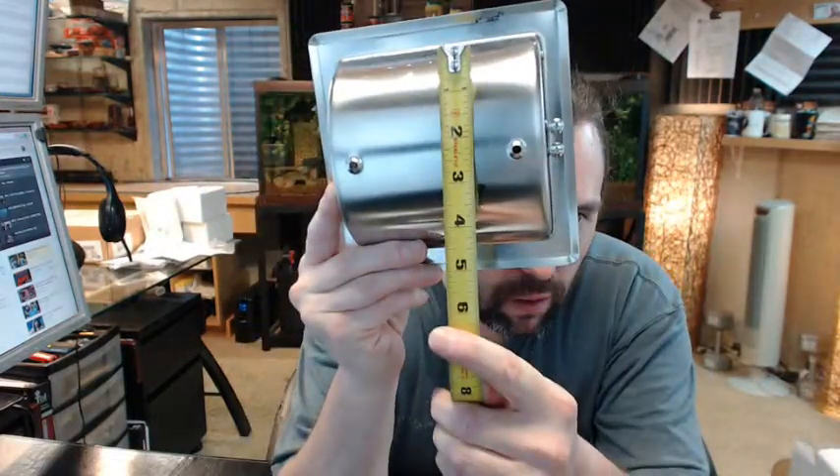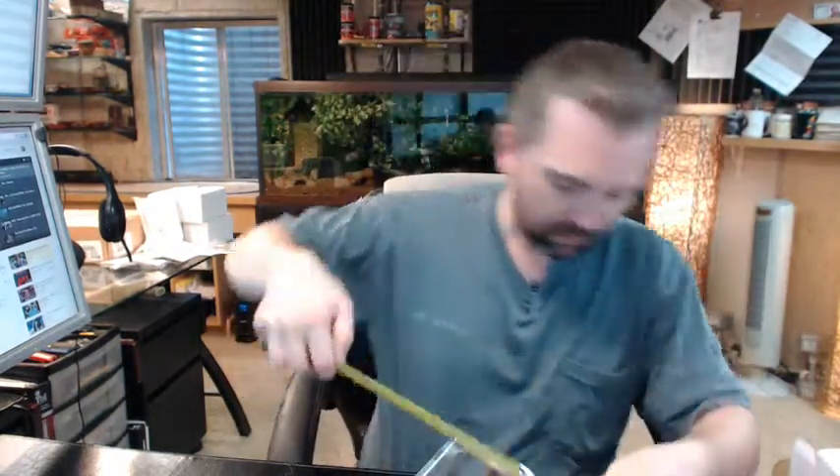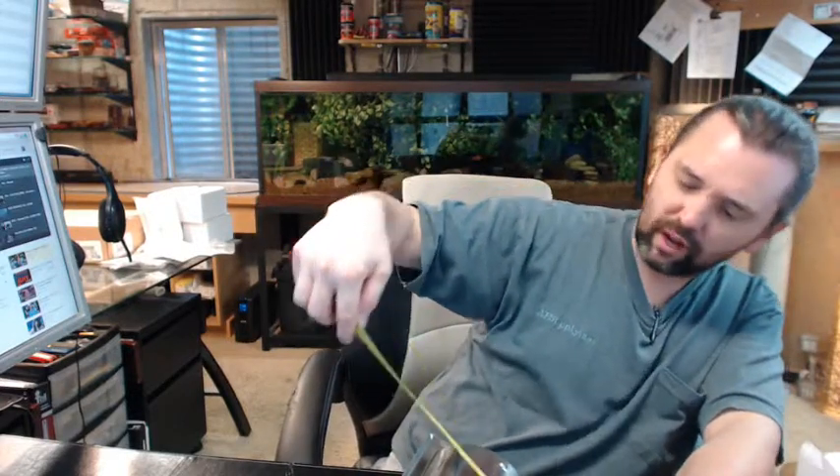For the 4 and 7/8 inch height, I would say that is going to look pretty good. It is hard to eyeball, but it looks like 4 and 7/8 would work real well — I might cheat that height a little bit. For the inch and 7/8 depth, that is going to work out fine. You would want it to pretty much compress against the back side, and if you had it an eighth of an inch deeper I don't think you would be in too big of trouble.